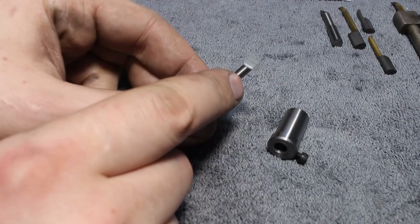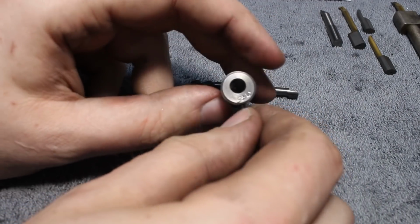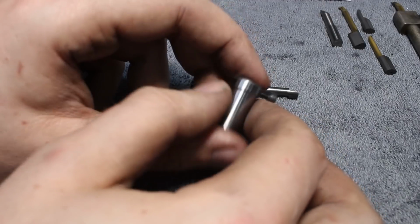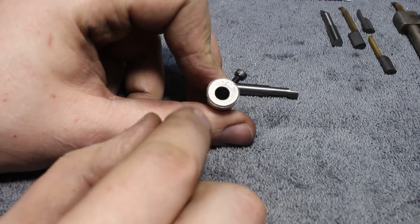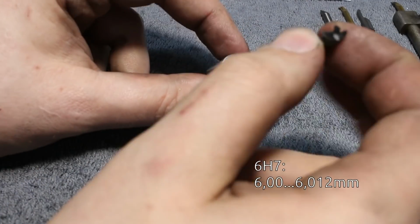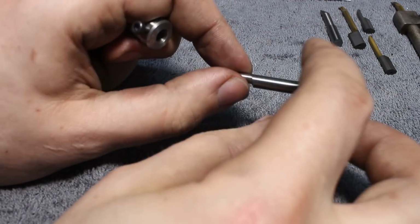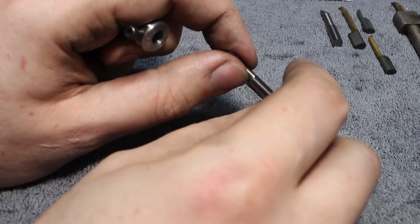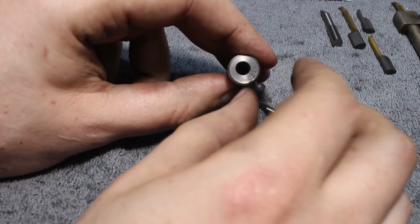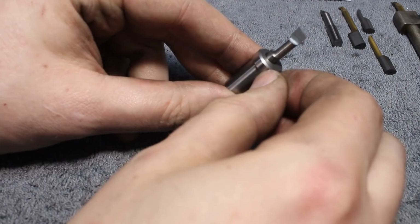And the way I ground this off-center neck relief here is just with a bushing, just a piece of 42CrMo4 steel, 12mm diameter here, goes in a collet on the D-bit grinder, 0.75mm off-center, drilled and reamed 6H7. That's a close sliding fit for 6mm carbide. Carbide tooling or carbide blanks are generally ground slightly minus diameter. It's drilled and tapped for a 3mm M3 screw here to clamp our boring bar blank for grinding.